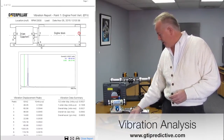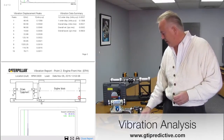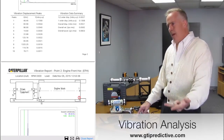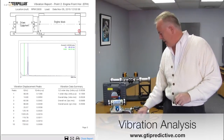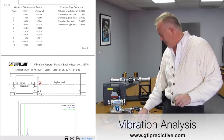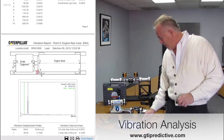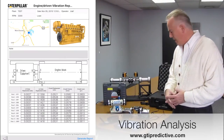As I scroll through, you'll see a red circle around the data where I took it — all the data that's included. This is overall by velocity, acceleration, displacement, and of course half speed and full speed and displacement as well, all depicted in this report. We hit close report and save report. It saves right to the device and we are done.